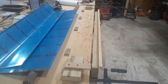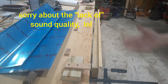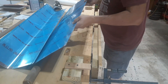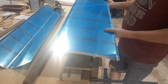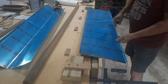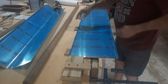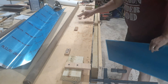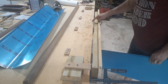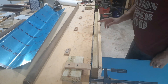I'm going to show you guys what I made here — this is a bending brake for leading edge sheet metal. It's 0.016 and I already kind of broke the half edges. What I have here are the stops and a 2x4 underneath this table to strengthen it up, a 2x6, and a little extra kick here.